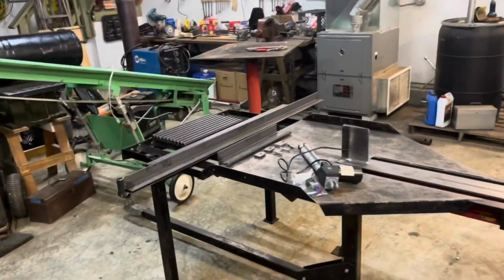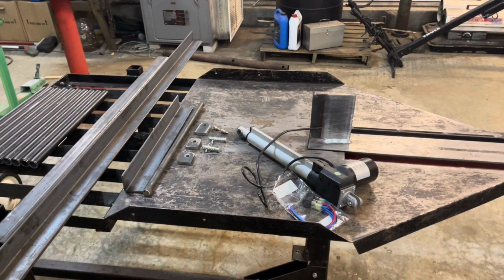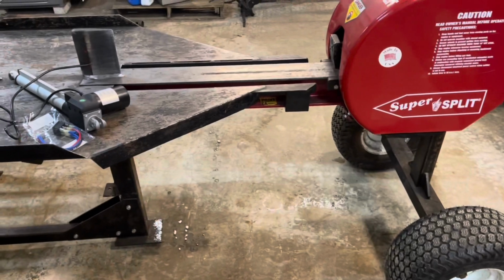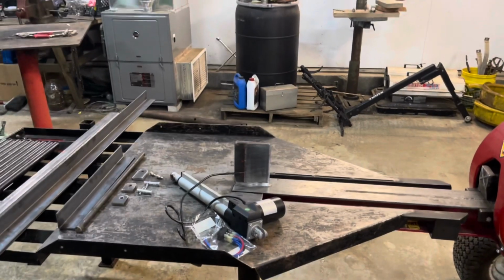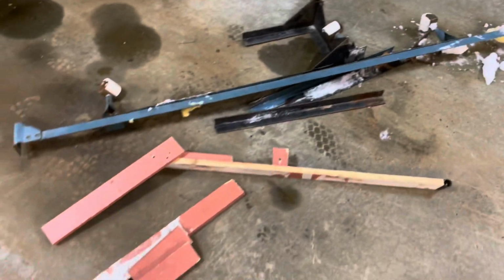And let's go over some of the components. So mine's gonna be powered by this electric actuator. That's gonna be powered by a battery, which will be sitting underneath on the beam. I'm gonna weld on a square tube that's gonna mount brackets to hold that and have a battery tray. So I had to do quite a bit of calculations and do some test fitting with some wooden patterns